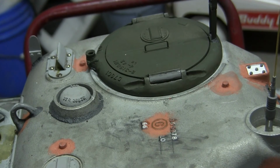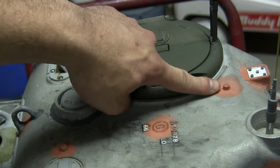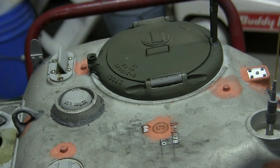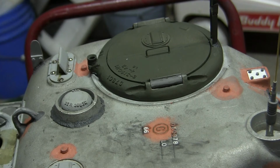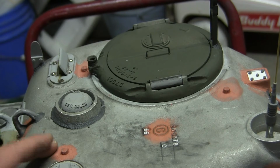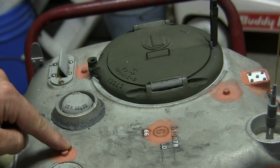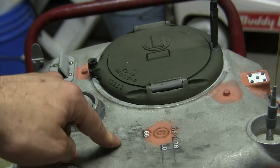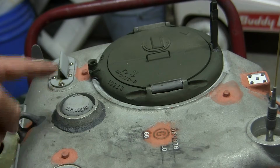Moving our way to the top portion of the turret gets us to the final details that were added. First, we'll start with the eyelet lifting mount nubs that we have here. Like I mentioned earlier, the Sherman's turret was originally designed to be lifted off the vehicle with that of eyelets that would thread into these nubs. Again, this is a carryover from the M3 Lee, but the eyelets were never utilized as the idea was scrapped for that of the thicker integrally molded lift hooks. However, even though the eyelet procedure was abandoned, the nub mounts were left in the turret castings. This progressed up until the advent of the late high bustle Sherman turret, in which these mounts were thereby deleted.